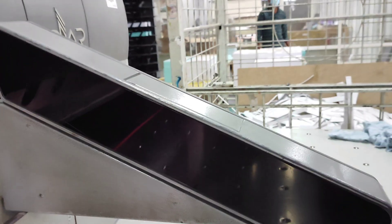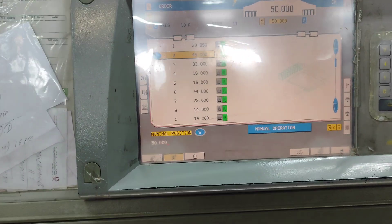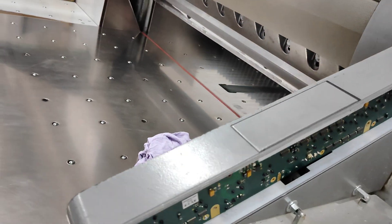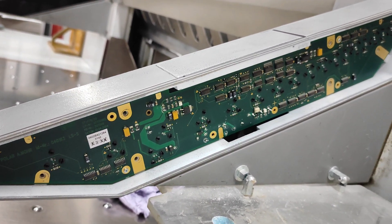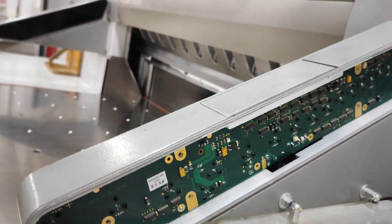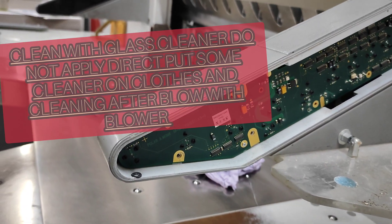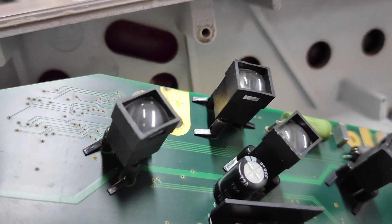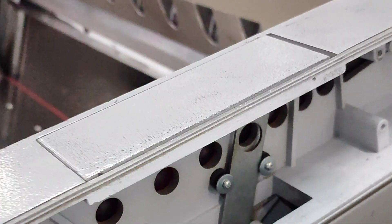We will go here also and open this one. We will clean it first. The error is still going on, so we will go deeper for further inspection. Now we open the right side light barrier — the gang sensor. We will clean this one and try again. The error is still going on, so let's clean this one also. The right side has more dust inside — we can see it here.